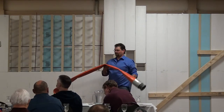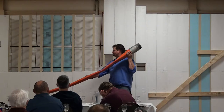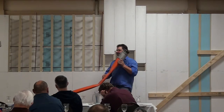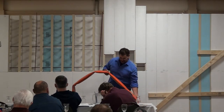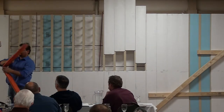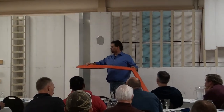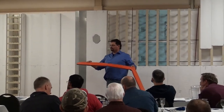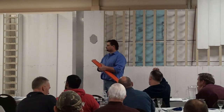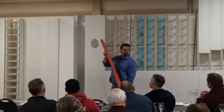That hose Jerry's holding right there is a flexible concrete hose called a mud snake, most commonly by truck drivers and users. It's the perfect hose for pouring concrete into ICFs because you can shut off that hose simply by bending it. You have full swaying capability to move the concrete where you want it, rather than relying solely on a rigid hose from the pump truck. If you're pouring a lot of concrete into ICF walls, you'd probably just want to buy your own hose so you always have it.